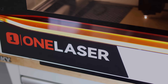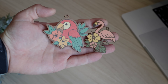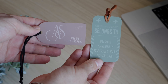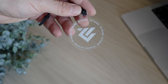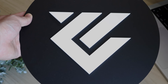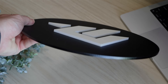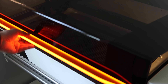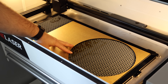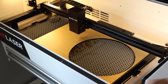Once the laser was in place, we jumped right into projects. We've been making UV-printed and laser-cut acrylic signs, key chains, plywood signage, key holders, bookmarks, earrings, luggage tags, cork coasters, plant markers — you name it. Dialing in the settings has been super easy. If you've used a diode or CO2 laser before, the workflow is familiar, but this machine just feels faster and cleaner. And here's the biggest thing: we can finally cut all colors of acrylic. Our diode and fiber lasers really struggle with that, especially white and light-colored sheets. The XRF? No problem — it slices right through like butter.